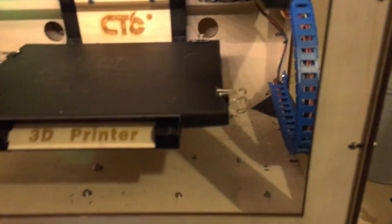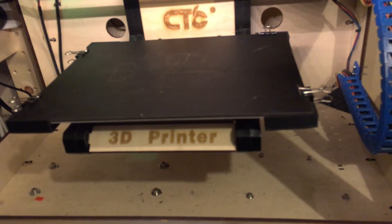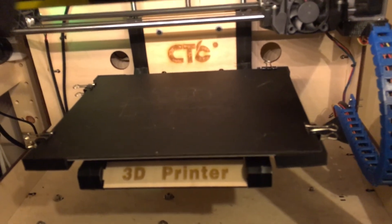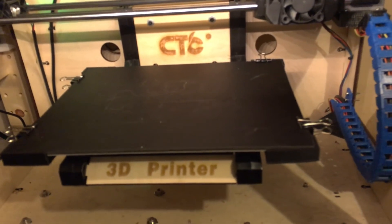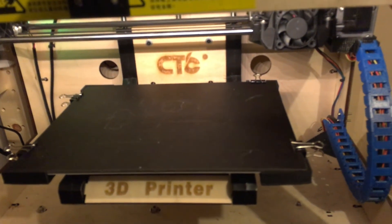Up the top here I have a Raspberry Pi — all my prints go through that. With that and the GPX plug-in I can print from Cura, and I can also print from Craftware. Technically neither of those support MakerBot-style printers, but because of the GPX plug-in it all works really well. I wouldn't use MakerBot desktop software for control at all because my prints were a lot worse when I was using that.